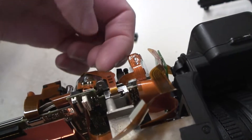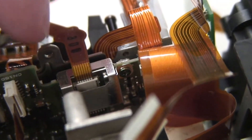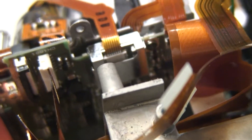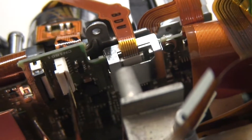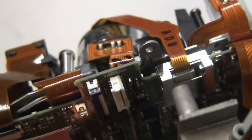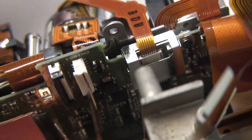This is where the heads connect — you can tell because it's got shielding on the cable, and that goes into this little connector here. That will be where the head amplifier is. Somewhere around there will probably be a test point where we would connect our oscilloscope to look at the RF output. If the RF output is too low, that means the heads might be a bit worn out; if the RF is nice, they're probably not worn out. Likewise I can put a known good tape in and use that RF signal to check the alignment.